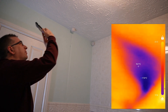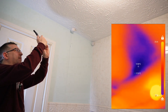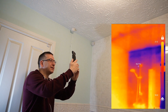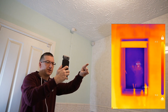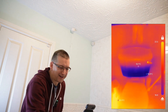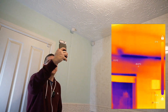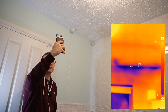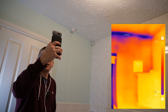All around there as well — that does surprise me. I don't know what that bit is but that's definitely a big cold spot. If I look at the rest of the ceiling you can clearly see it's a shower, and there's a reflection of me in the window too. There's clearly water in the system, and there's a big gap across there against the wall — that's an outside wall so that needs looking at. The extractor fan is surprisingly warmer than everything else.